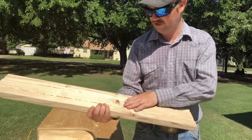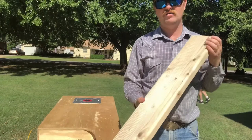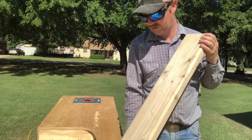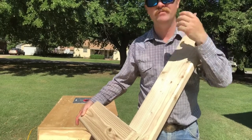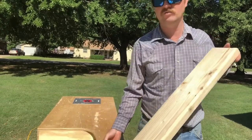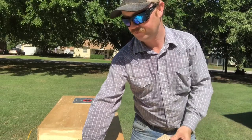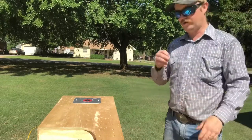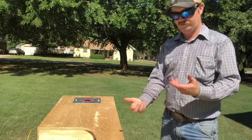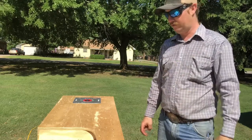So we have our V-groove in the back here, round-over on the edges, and when you put these up, this will be each shutter back. Set that a little bit and you'll have your three rails here. I'll show you what some look like that I've got laying out for stain now. That's all there is to it - a fairly simple little project. Then screw together from the back - if I can, I'll do a little clip on that too.